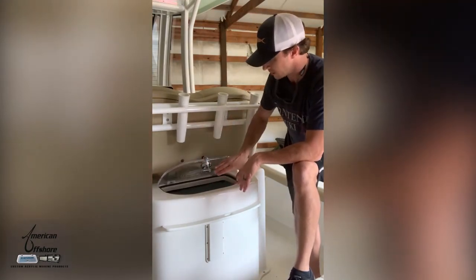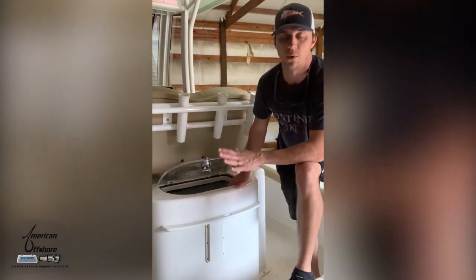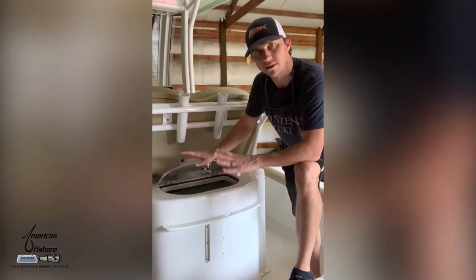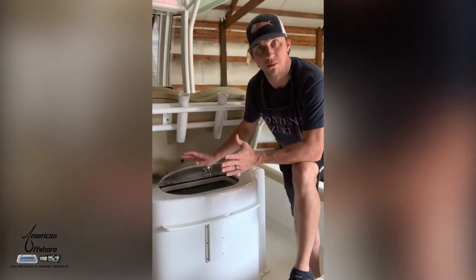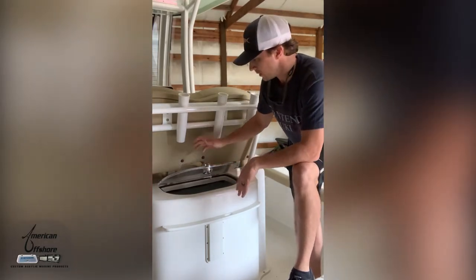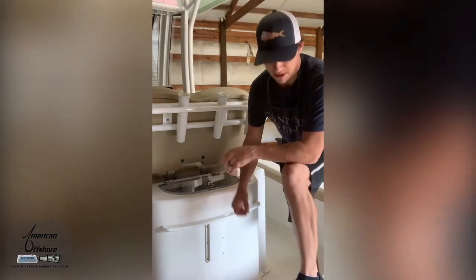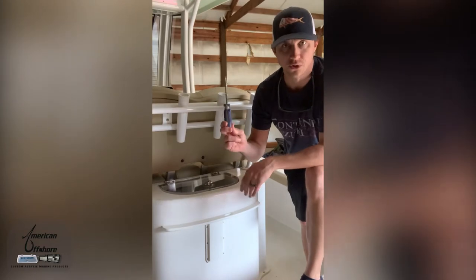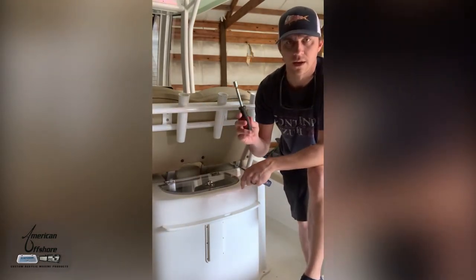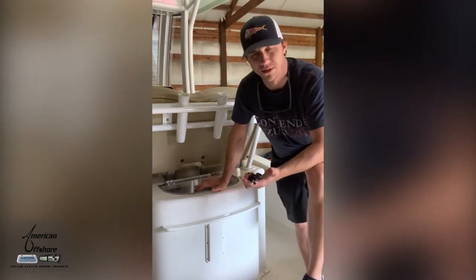You want to make sure that the latch matches up well with your weather seal and whatever components you may have. So send us those specs. That's the very first thing that you want to do to get the process started, and we'll get you a quote from those things. So to remove this livewell lid, I've already looked at what's needed, and basically we just need a Phillips head screwdriver and a 3/8 inch socket, and that's all you're going to need to remove this. It's a piece of cake, probably takes 5 minutes tops.